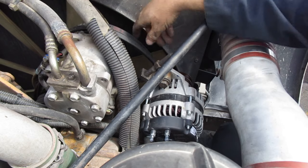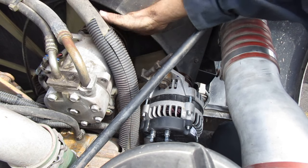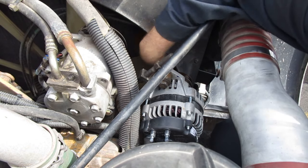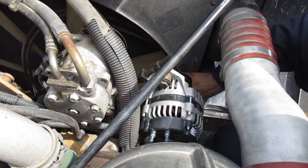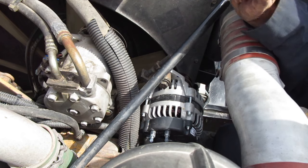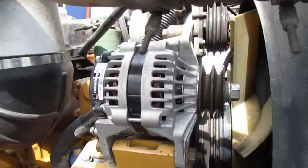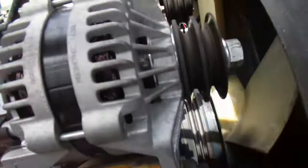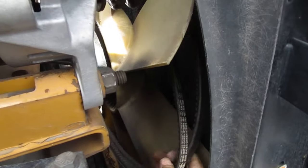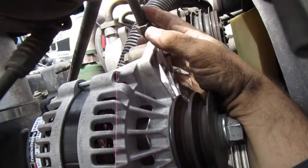The belts are loose now. What you do is just take them and loop them around the fan blades all the way around — like this. That's all you have to do, just loop them around like that. So the belts are off and then you just loop it around the fan blades. Then you've got the tensioning bolt right there. Let me go to the other side to show you.